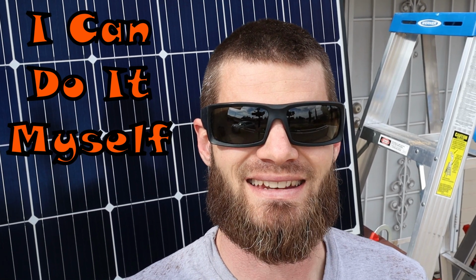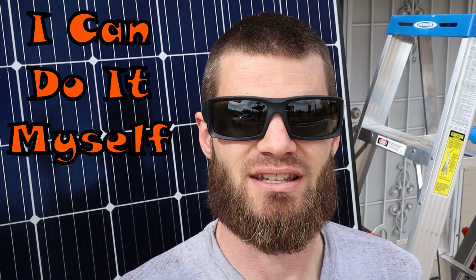Welcome back to my DIY solar install. This is part 8 in the series. Just got done with my first inspection with only one thing being pointed out. I need to lengthen the cables and/or wiring in between the disconnect and the main PV breaker in the main panel. But here we are.